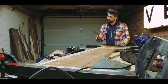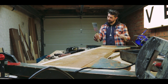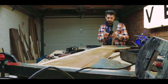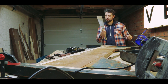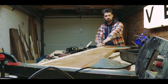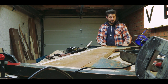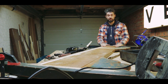It went rather well thanks to this fancy Japanese pull saw — another fun thing I learned from the interwebs. I used to have this thing, my plakhoutsag, but it's only good for really short things, like two or three centimeters you can cut off. In order to get under all these boards, I was able to do it with this. I had to cut this bottom plank off because it is completely joined through to the front, which is painted nice and green. These sideboards were put in with all these dowels and stuff, and I want to preserve as much of the front as possible.